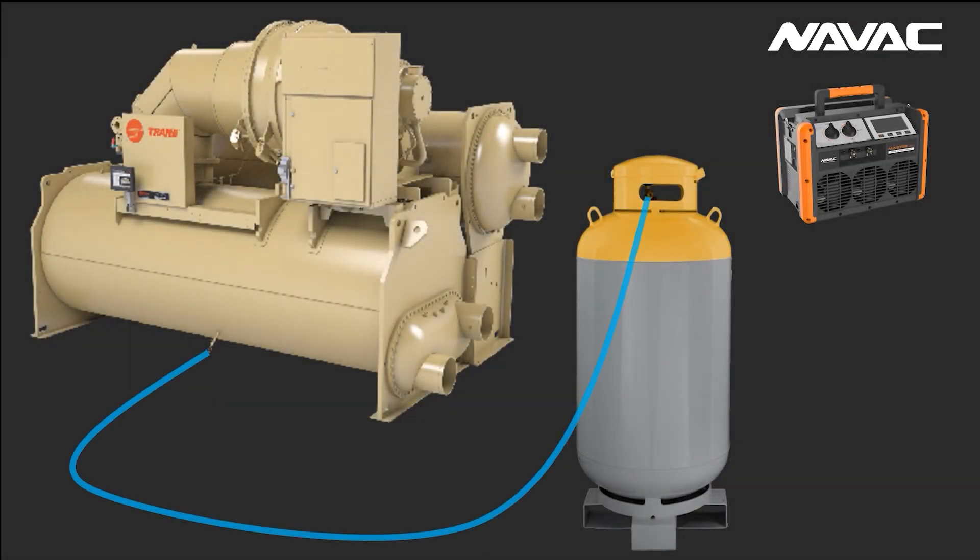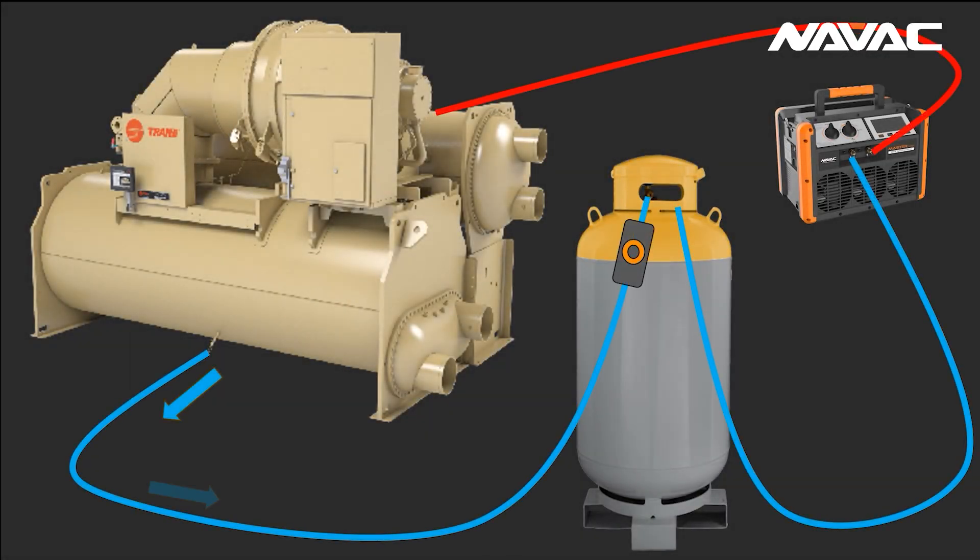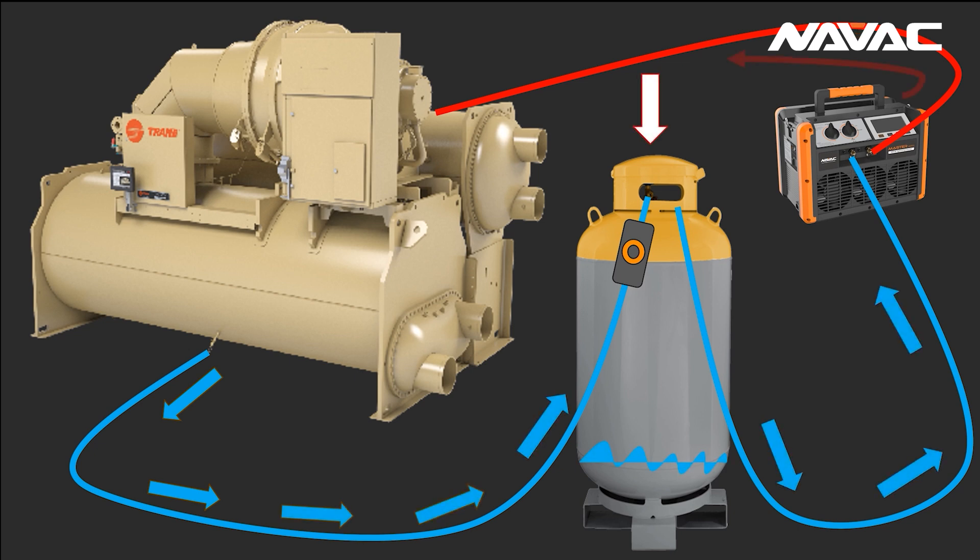For those of you involved in areas of the industry that conduct push-pull recoveries — which is a type of recovery that involves the fast removal of liquid — if you're looking at over 50 pounds of refrigerant, I would consider it a worthwhile expenditure to set up for push-pull recovery. Push-pull recovery, without going into too much detail, is when we are harnessing the power of the equipment's refrigerant to cycle back into the equipment as a high-pressure, high-temperature, superheated vapor, giving us the pressing motion on the liquid in the system.